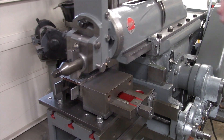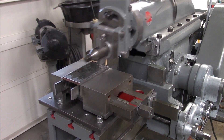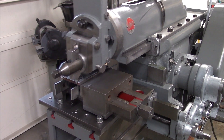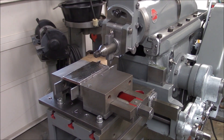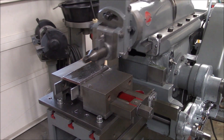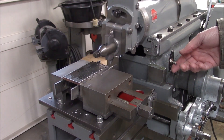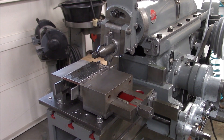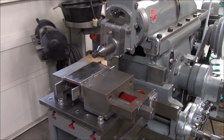I've slowed the stroke time down just to make it easier to do the downfeed. Okay, touching off. That's 40 — let's just let it spring out. Now we're going to stop. Back out on our downfeed. Stepping over 100 thousandths.